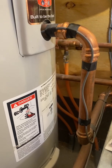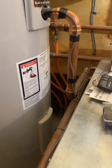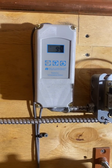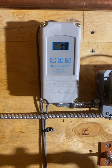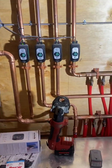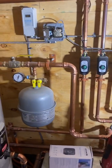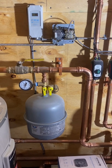If you look at the top, you'll see a wire strapped to it — that is our temperature sensor for the temp control for the heat pump, which triggers the heat pump to run. That's controlled by this Ranco temp control. Right now the heat pump is running; we've got it set for 105 degrees because we have in-floor heat loops in the house fed by these zone valves. He's going to be putting tile down, so we won't need much hotter than 100 degrees. We're in a climate up here where we can see 30 below zero Fahrenheit.